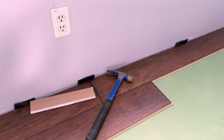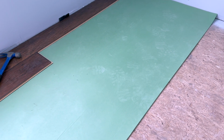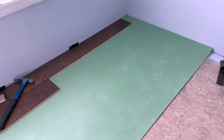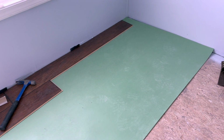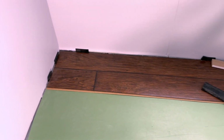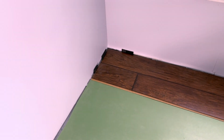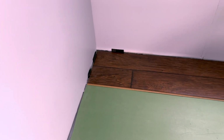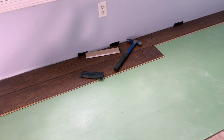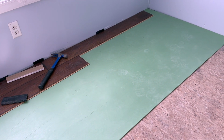This is a small room of flooring and we're going to have it on top of this foam paper underlayment. So it ought to move around fairly easily if we find we're getting off square at any point. Should be a simple matter to move the whole floor around. And that may seem like a monumental task, but when we did the flooring in the depot, we had to start in a bedroom and then connect up with the dining room passing through a hallway because we didn't want any transitions. And it was substantially off angle when we got there.